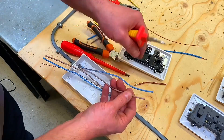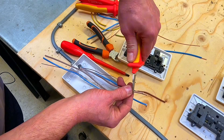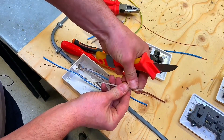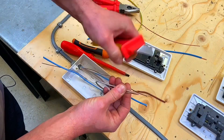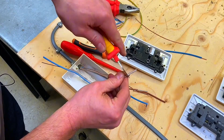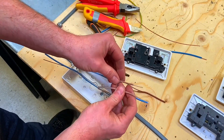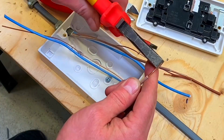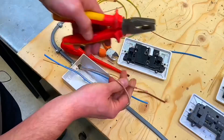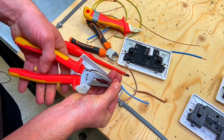Let's start off with the line. Some people remove the insulation around the brown line conductor using other kit, but I'm going to use my knife as usual. Press nice and firmly and pop that one off. Remembering the insulation material around here is thermoplastic PVC which has a maximum operating temperature of 70 degrees C. Ready to double these over - slightly less than half, fold them against the pliers and close up the gap. Do the same with the second one, then we can do the neutrals afterwards.